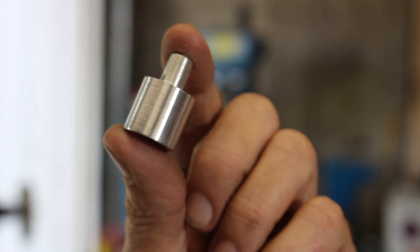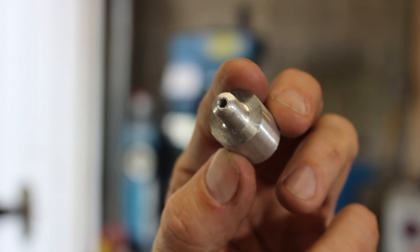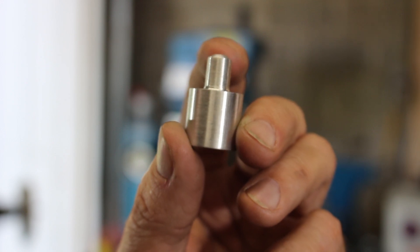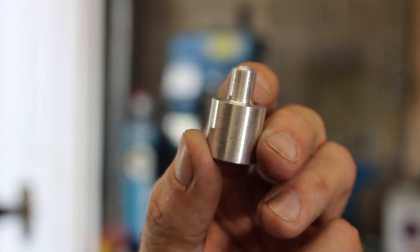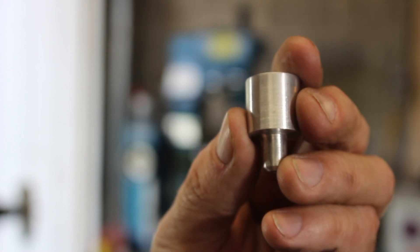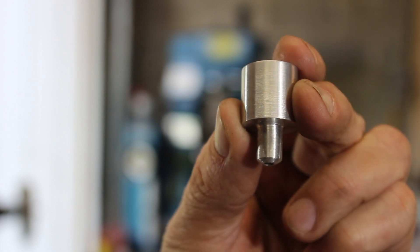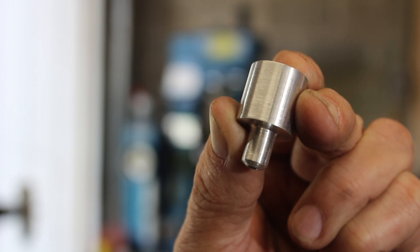The camera battery died while I was making it, but this is what I came up with: it's a 3/8-inch tip with the same angle as a 3/8-inch drill bit on the end. That way, when we make the mold, we just drill a hole with a 3/8-inch drill bit and this should mate into it perfectly. It's got a little dish on the inside, and I just polished it with some 400-grit sandpaper. Now I need to freeze this and heat the barrel and press the two together.